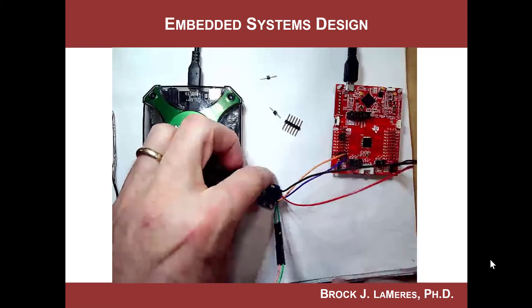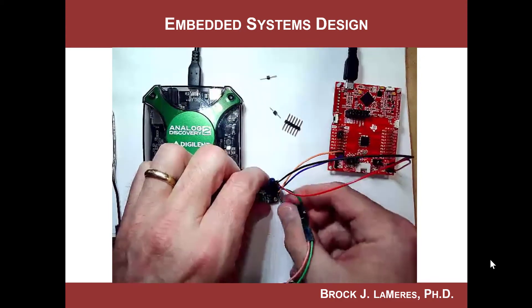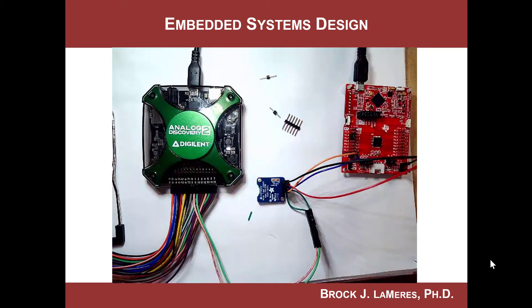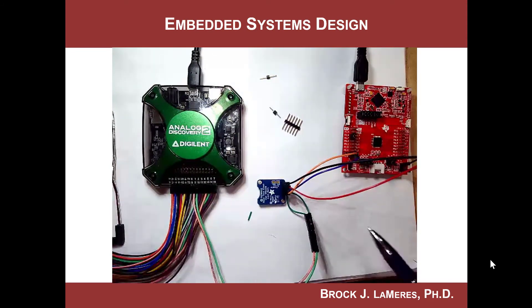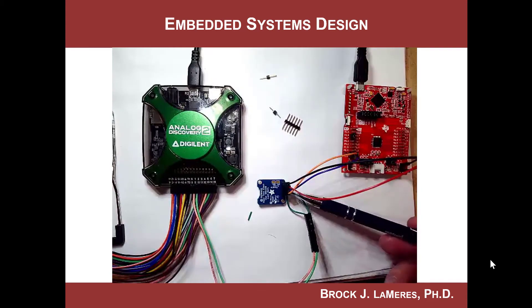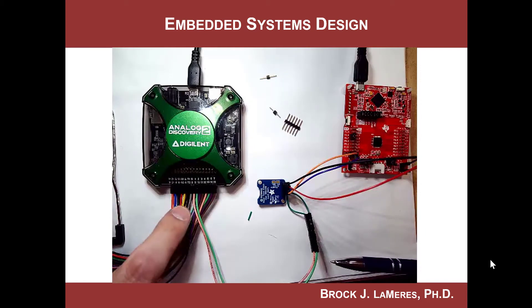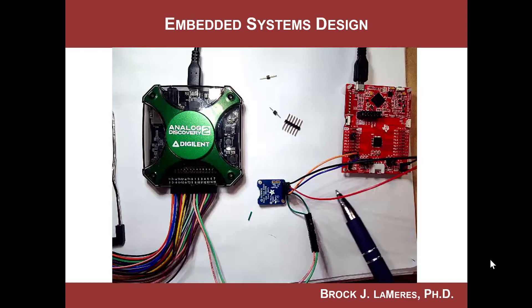Make sure the exposed wires down here aren't touching each other — just pull them apart. Once you get it working, don't change the setup; once nothing is shorted out you're good to go. Verifying: the outermost wire goes to port 1 bit 3, which is the I2C B0 clock, and also to channel zero of the Analog Discovery. The next one is data, going to port 1 bit 2 and also to channel one of the Analog Discovery. Then power on red goes to 3.3V and ground goes to ground.